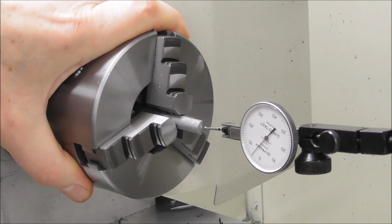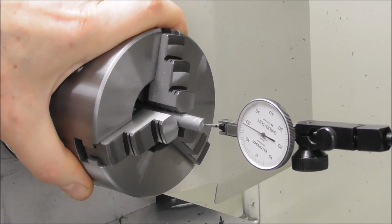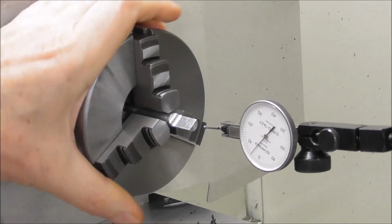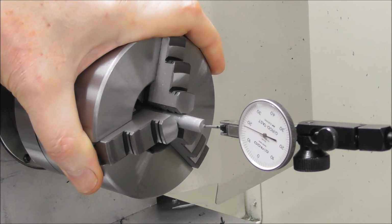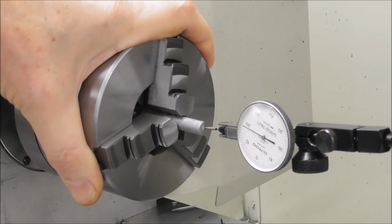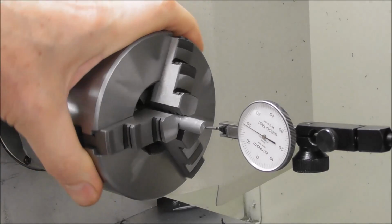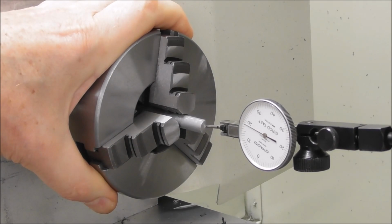If I come in there on that flat with a dial indicator, I'm getting about, what's that, about 19 and a half there. Now if I rotate this around 90 degrees, well, let me show you something else I noticed that I was hoping would be the case. At 19 and a half there. Now it doesn't actually matter that much that it's perfectly vertical, because it takes quite a few degrees, as long as you are on center in that direction, before it starts to become an issue. So as long as you're roughly aligned,